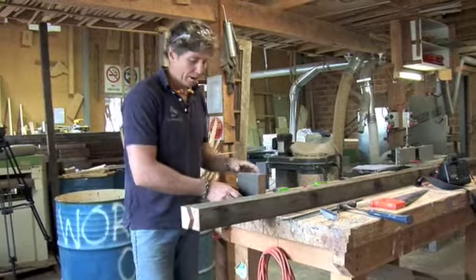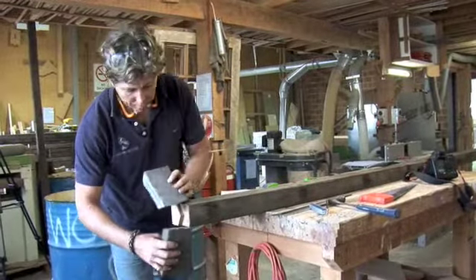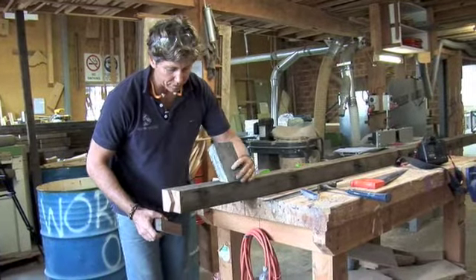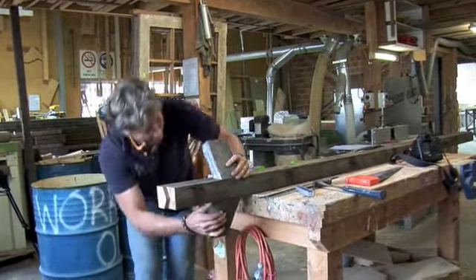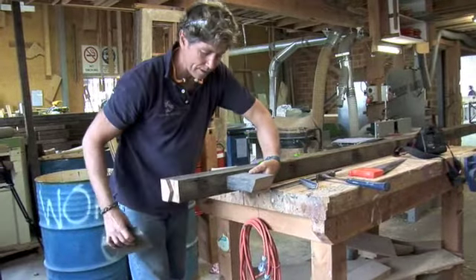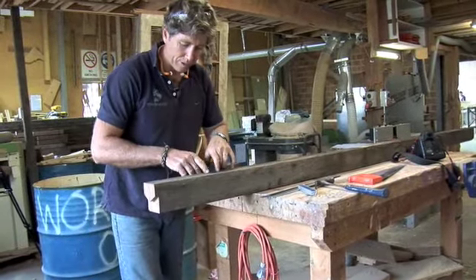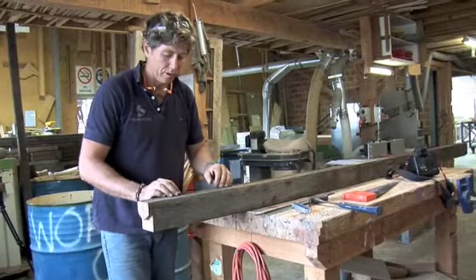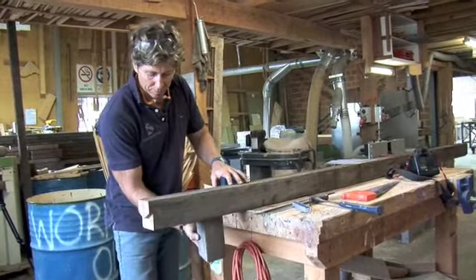Another thing to show while we're at it: here's the notch for where the top trimmers sit in — that's looking at the post. We've also got some mid trimmers; I've marked down 220 millimetres to that mark, and the mid trimmers are going to sit there like that. We're also going to have a rafter that comes out of the front side of the post. On the back I've marked a couple of holes — we're going to drill those clearance holes now, because it's much easier to drill in the workshop before you start putting the structure together, ready for the screws that will hold the rafter in place.